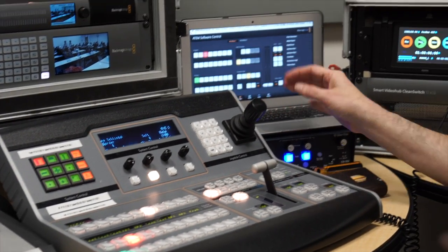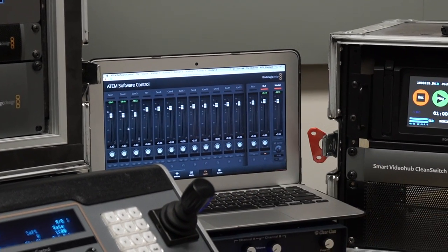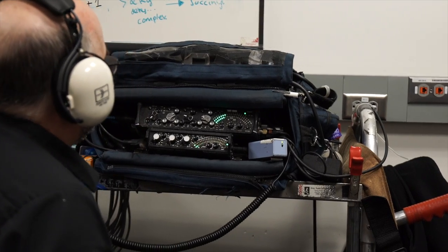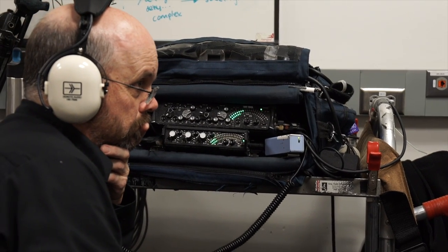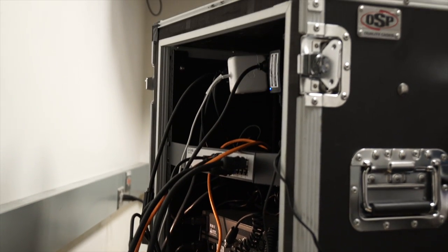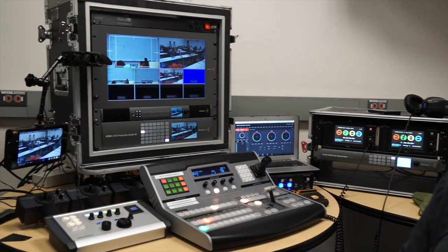You can switch the show, but you've got to be able to turn off the audio channels because by default the studio cameras turn on when you hook them in — so you'll have live audio from those cameras coming through the setup. We bring an audio guy with us, and we take an XLR feed in, it gets SDI encoded, and goes straight to the recorders. It comes into the back of the ATEM, the ATEM embeds it, and everything is timed correctly so there's no delay at the recorders.